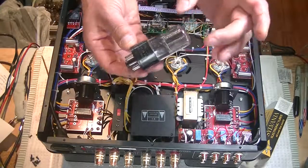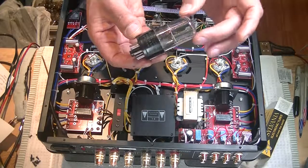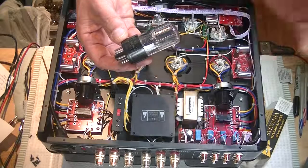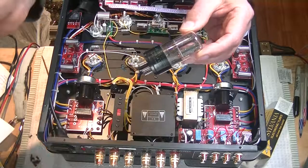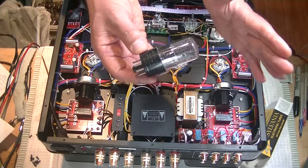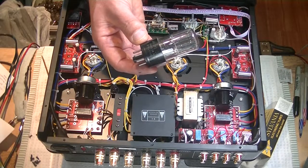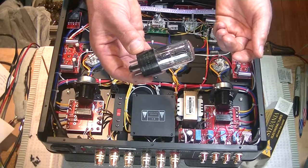But one of the reasons I'm buying the 12SN7 bad boys is because the 6SN7s are so hard to find at any price. Many of them come in noisy. Many of them test really weird. They're 70 years old, they're antiques, and finding affordable new old stock doesn't happen anymore, folks. But you can occasionally find nice new old stock 12SN7s. So when I build preamps these days, I'm building universal heaters, so I'll be able to switch over to a 6-volt heater or a 12-volt heater.